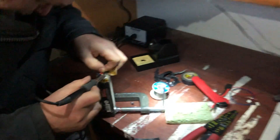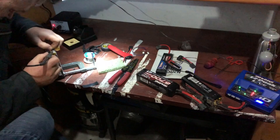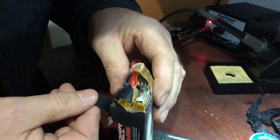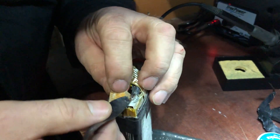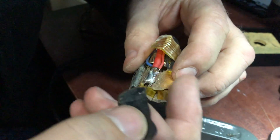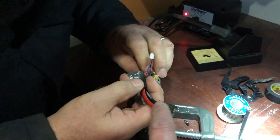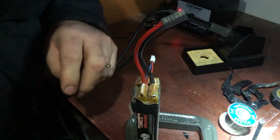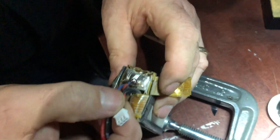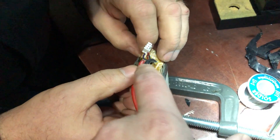Don't come to me to fix your batteries — this is a don't-try-this-at-home situation. He's done this before and had success, so I asked if he'd be willing to try it again on mine, and so far it's working. I just hate to throw these away. If the only problem is that none of them were balancing properly anymore, it seems like such a shame to throw away hundreds of dollars in batteries just because of that. We're covering up the other leads to make sure we can't cause any shorts. Don't cut off that protection film — just slit it and peel it back so you can still cover it up afterwards. Almost all the breakages so far have been the main red and black wire going to the two main power leads. The blue one is already done — all three are done. Look how efficient this guy is.